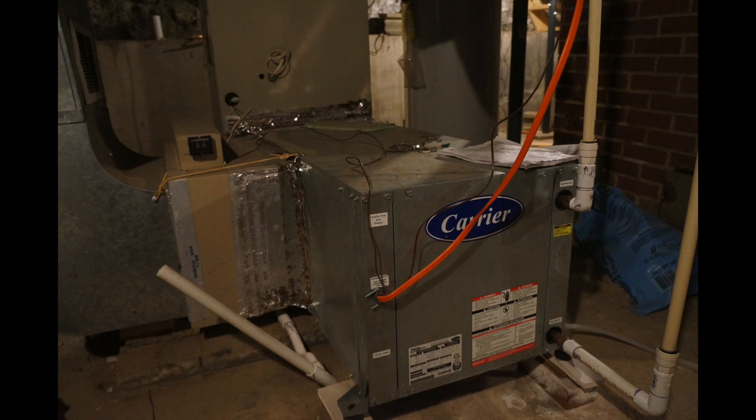I'm not going to go into any details on how I did the duct work. Basically I just added the unit in between my return and my furnace. Originally the return was aligned along the axis of the geothermal unit, so I had to turn it 90 degrees. The return air comes from the top left of this picture and makes a 90-degree turn inside the geothermal unit. It took a little bit of work, but it really wasn't too bad — mostly menial cutting of metal and taping gaps.